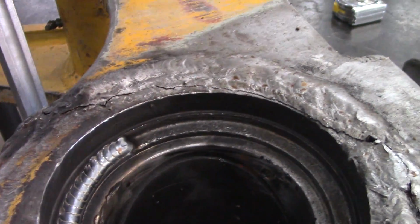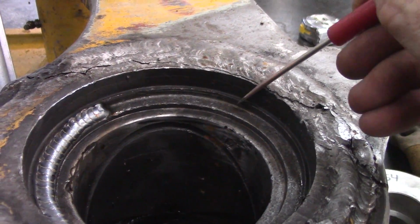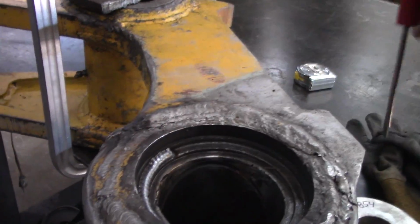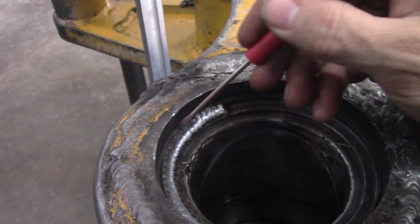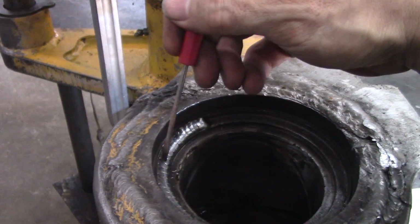The lip. Let me get my pointer out here. Oh, it's about 3/16 or almost a 1/4 inch worn in there. This thing was flopping back and forth. So I'm just gonna build up a cushion of weld, see what I started here. And I thought, I better build that up. So I'm gonna build up another one, or finish that one, and put another one over the top.